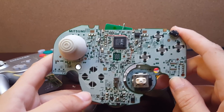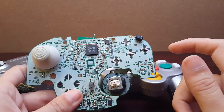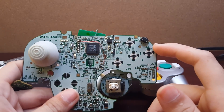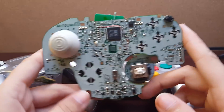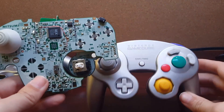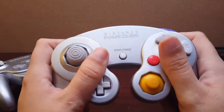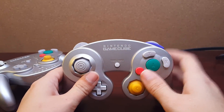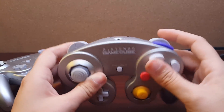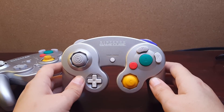I am going to continue testing this, and eventually I'd like to make a custom circuit board where I can transplant these chips and have convenient soldering tabs for the different buttons, in order to put them into other controllers — the N64 controller in particular. But if you guys want to do it yourselves, feel free; there is a trimming guide. With this one I just trimmed it and rewired a few things, and it wasn't that hard — all the buttons just fit. They must have copy-pasted everything from the original circuit because it fits exactly and looks and feels just like a regular wired controller.